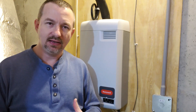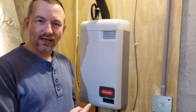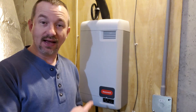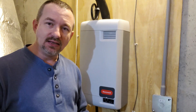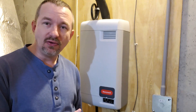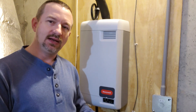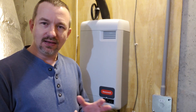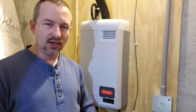Today I'm going to talk about my steam humidifier. I'm getting the four yellow light flash diagnostic code, and I looked up in the manual — it means that the steam tank on the inside, which has the electrode in it, is scaled and needs to be replaced.